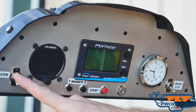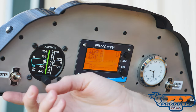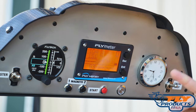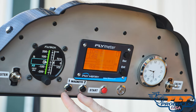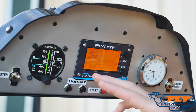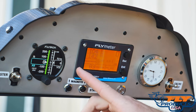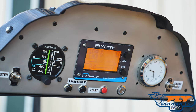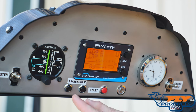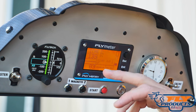The engine still runs just fine with the master switch off. The motor is turned on, master switch is on, engine stop is on, and we're going to talk about the magnetos. I'm going to start the machine and push Magneto 1. We're going to get about a 40 to 50% drop in RPM with only Magneto 1 pushed. When I let it go, it'll return to its standard RPM. With Magneto 2, it will seem like nothing happens, but when you push both of them, it kills the engine — so we know Magneto 2 is working as it should.